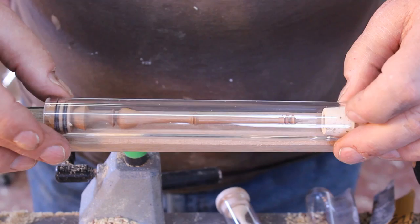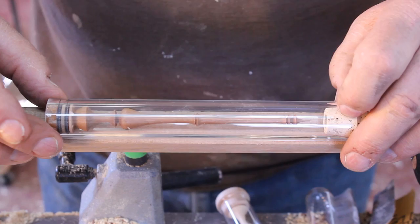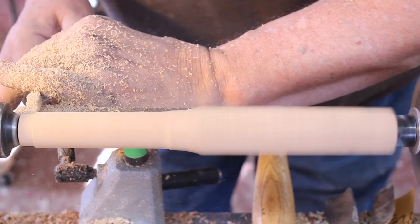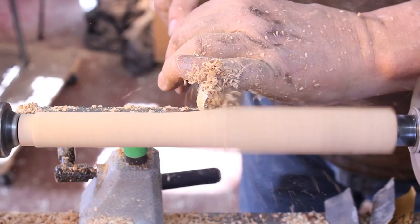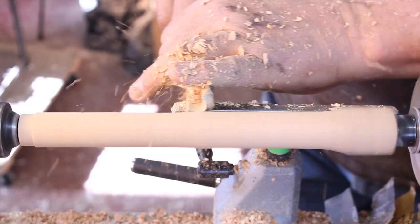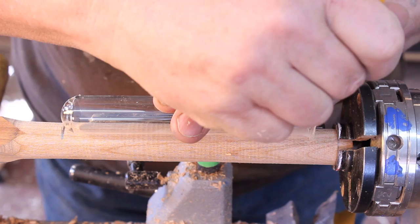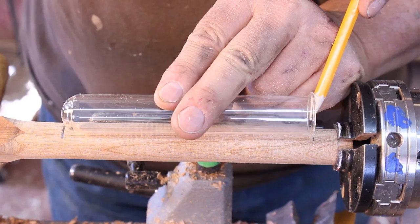That's what I'm going to be doing at the Quick Draw on the 21st of November, and I'm going to do one right now. In this next segment the film is speeded up a bit. I'm first establishing a tenon for my pin jaws, then doing just a bit of rough turning with my spindle roughing gouge to get this down where I can work it with the spindle gouge. Now I've got my glass tube and I'm going to mark the length of my finial. Back here I'm going to leave a little bit of thickness, and this end will be wedged into my glass tube.